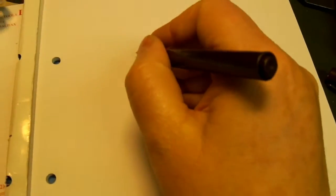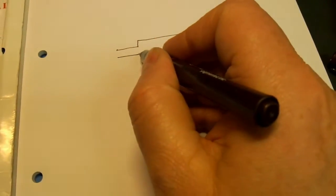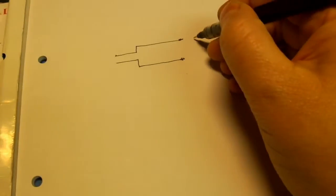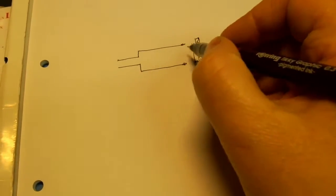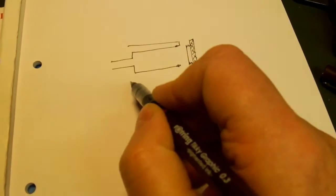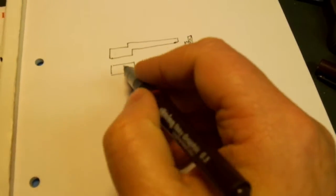So it's basically a... You've got, inside, it looks like this. So, like so, this is threaded internally. There's a threaded cap like so, which has got knurling on it, which is the back cap. This then is sort of like that. On mine it's sort of waisted down to 1¼ inches, which, as I say, is a standard for telescopes.